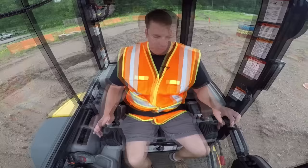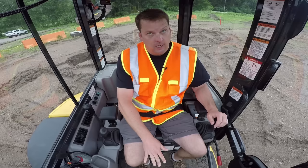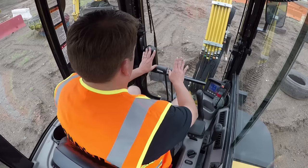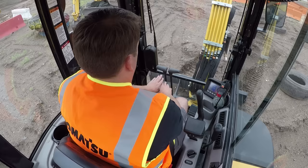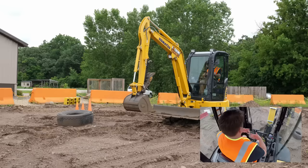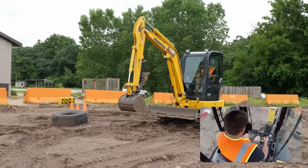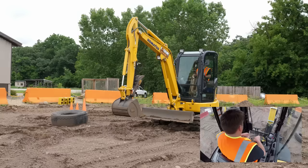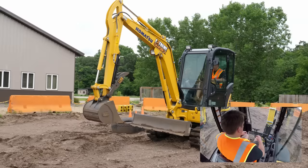Those are all the basic controls. Now we're going to get into driving. First and foremost, make sure that blade is up — it's not going to drive well with it down. Mini excavator driving is similar to big excavators with two track pedals or foot controls. Every new operator, we always train them with their hands. On the minis, there are two little pieces. An expert would use their feet — pushing both moves forward, each one controls one track; push left for the left track, push back to go backwards. I'm going to push both and drive forward.